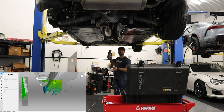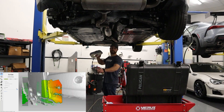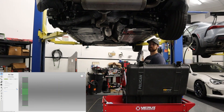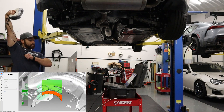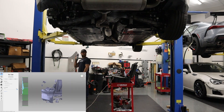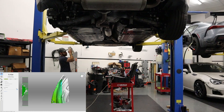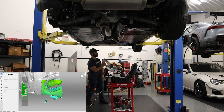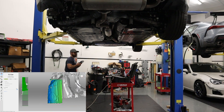That color feedback kind of helps you while you're scanning to basically see how the scanner is tracking. The whole goal during this is to get a lot of overlapping data so that the scan comes through properly and dimensioned well. I then go back and get very close details, like that fender vent right there, to ensure that we can actually CFD that through-vent and see how it does in CFD.